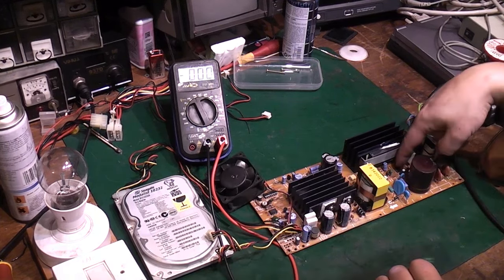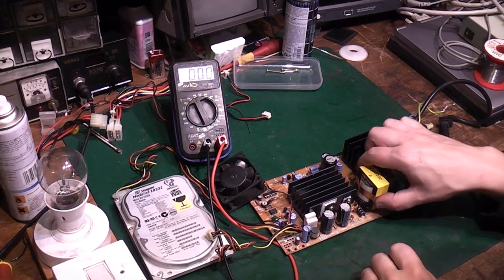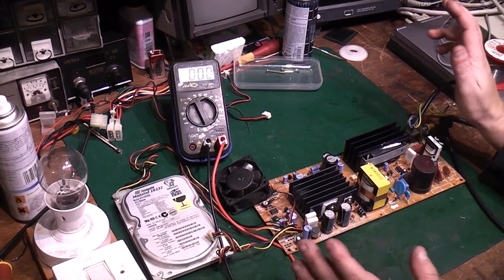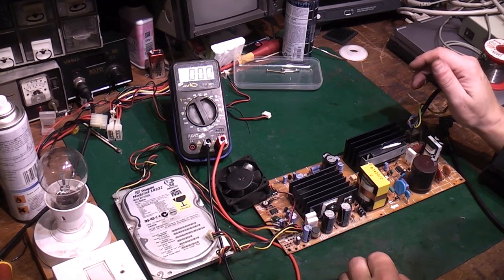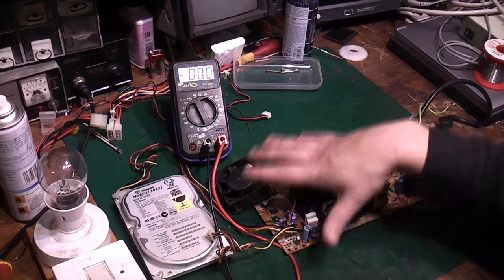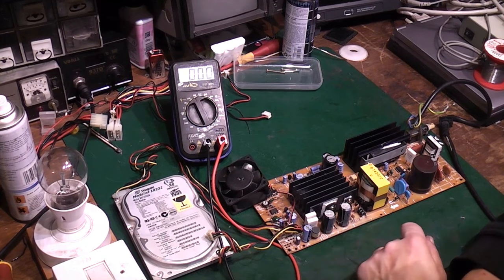There was a chip there which is obviously part of the control logic. We could have a look at that, see what the pinout for that is. We might be looking at seeing whether we can put a different board in that case though. Like I said, my knowledge of switch mode power supplies is not brilliant. I'm not an expert with them or anything. I could check certain things, I know certain things. I'm pretty certain that that side of it actually is not too bad, the low voltage side. Like I said, we've certainly checked all these parts that are potentials to short, and they're all absolutely fine.